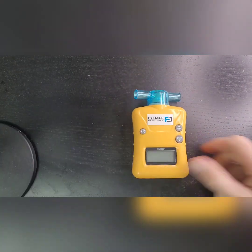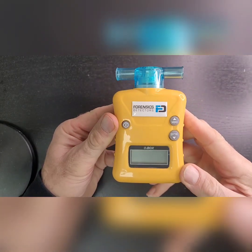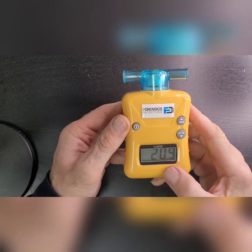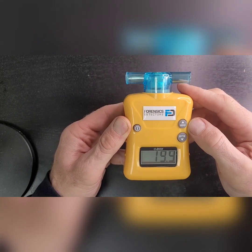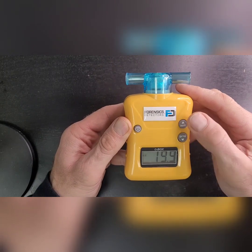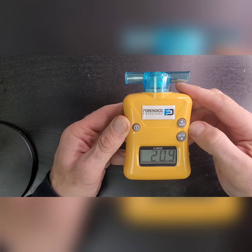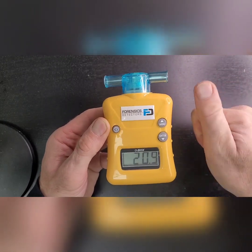And we are done! The unit is there, we've replaced the sensor. Turn it on and it's reading 20.9 — that's fine. If it's not reading 20.9 and it's wavering and going all over the place, just calibrate it. Make sure to calibrate. Any other questions, let us know — have a great day!